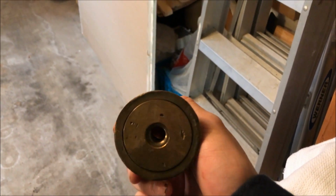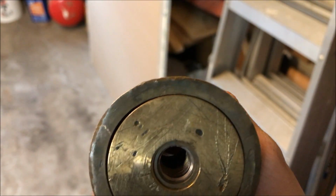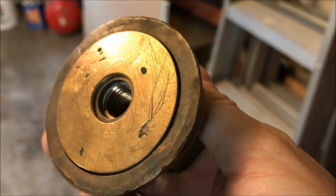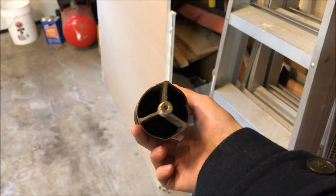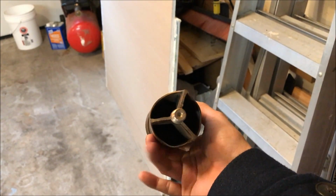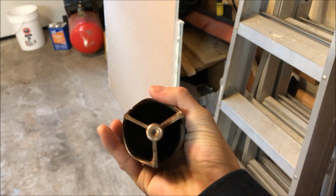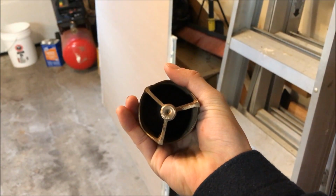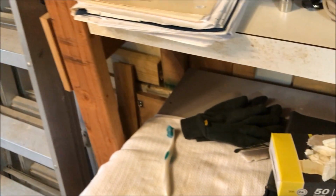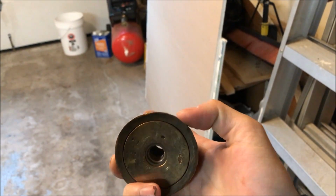So if you can look here, the ring is a bit misaligned. You have a little tight portion up here, and the rest of it is sort of open. What that does is redirect the flow of air at a certain angle, so it doesn't hit the bell properly. And obviously, as I noted earlier, there is a bit of a dent on this side of the bell housing. So that may play a role in why this whistle doesn't want to blow well anywhere over 65 pounds of air. If there's a way to fix that, I'm not aware, other than maybe an extensive reconstruction, which I don't know if it'd be worth it or not.